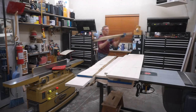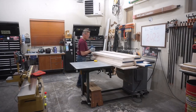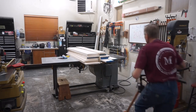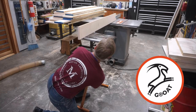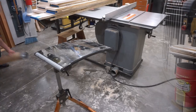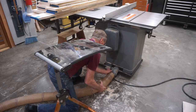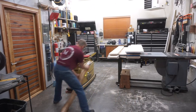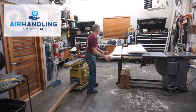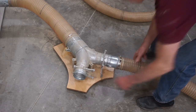Once the straightening process is complete and every plank has a perfectly straight edge oriented to my right, I do another minor reset of equipment so that I can perform the next step — ripping each one of these blanks to a rough width of five and three eighths inches or greater, so that they're more consistent in width for future steps. This is also an opportunity to see how my exclusive Grote tangent ramp outfeed roller stands work in action, and how my flex duct system provides hookups for dust collection each time the shop gets reconfigured. If you ever need dust collection hoses or fittings, just reach out to my friends at Air Handling Systems.